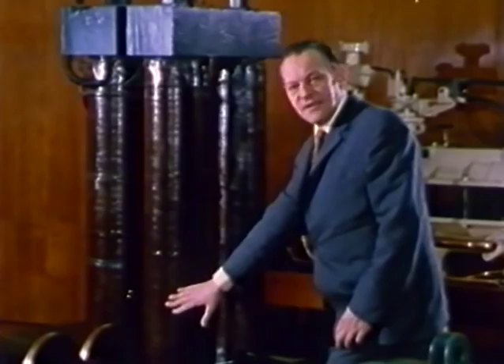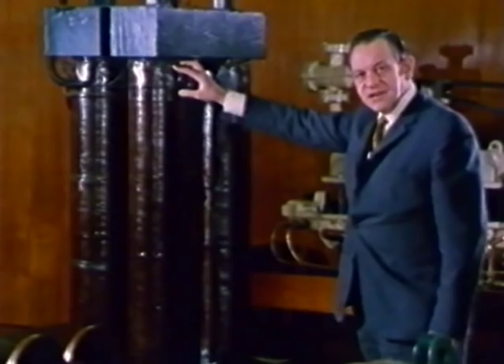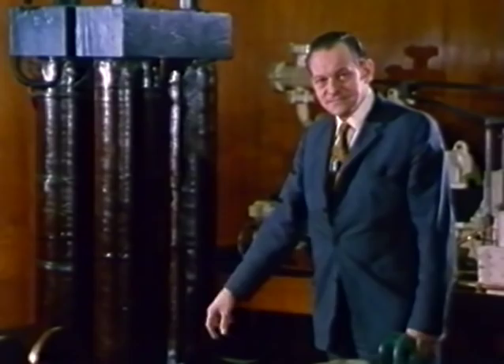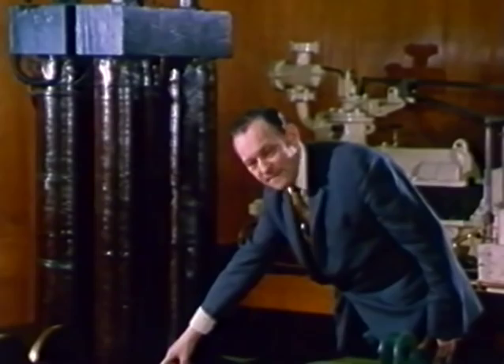One of the difficulties that designers of this period got themselves into was that they believed, quite wrongly, that you made better magnets when you made them long. So they finished up with all this wasted space through using these long magnets — and they made the same mistake with the previous machine, where the magnets were arranged axially. Nearly four feet of electromagnet and nearly all of it wasted. Such was the obsession about 1880 with magnetic length. Indeed, one author is on record as having said that it was always a good idea to let the magnetic flux have a good run at the air gap.